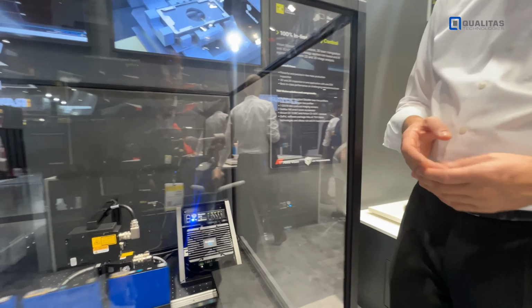So that's one of the, I think, big advantages of LMI, right? We can buddy the sensors. Three systems calibrated together. Yes, because calibration in 3D is 3, 4, 5, 6 degrees of freedom you have to calibrate. And when you have 2 or 3, then it's even worse. So you end up in this case maybe with 24 degrees of freedom calibration. And this is really extremely painful.